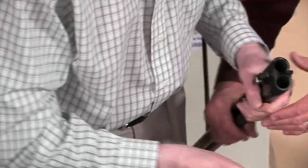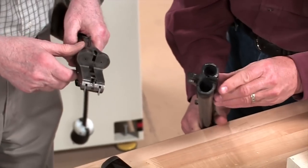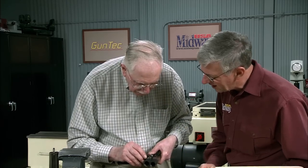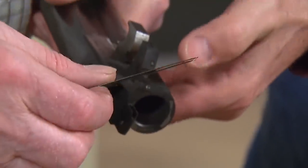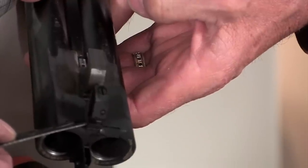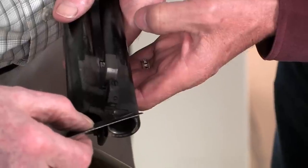Now let's take a real good look at it up here. We can see where it's touching — it's touching on the face quite nicely actually. And we can see where the soot has come off. But you see, it's not touching on the bottom there — the bottoms of the barrels are not touching at all. There's maybe a little bit there but nothing significant, and they're not touching there either.